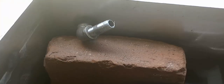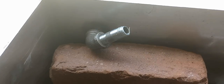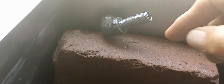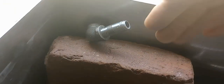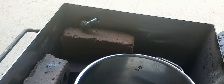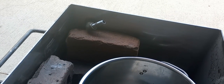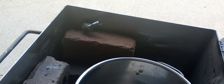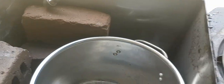The little overflow here, it's just a pipe nipple that you can adjust, turn up and down to get your level exactly where you want it. Just stick a screwdriver in there and move it up and down a little bit. When you're installing that in the side and welding it in, just make sure you turn it fairly tight so it will stay in position when you adjust it. If it's too loose, it'll flop around. So anyway,